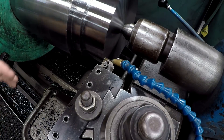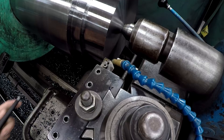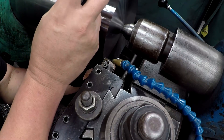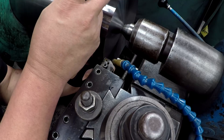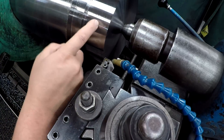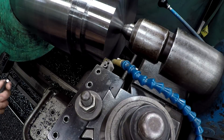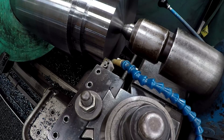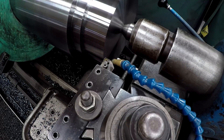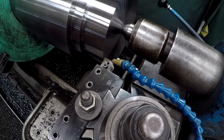I don't plan on filming the whole thing - I need to get going and get this done and out of the machine. I've got a lot of work to do, but I'll give you some highlights along the way. I've got my sample shaft mic'd and measured out, all my dimensions written down - journal shoulder distance and diameters - double checked everything. I left that journal a quarter inch big, so we're going to take a hundred thousandths.